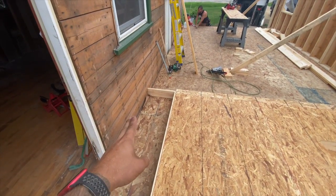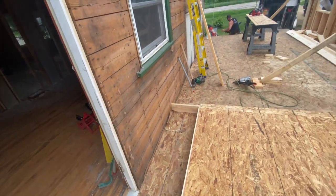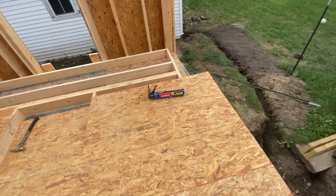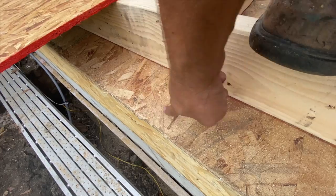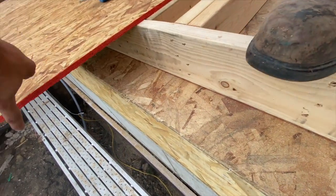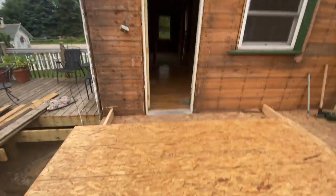We're going to leave this last stud out and fasten it to the wall nice and tight. We're going to pop this window and stand it up. Adam's going to run some PL Quick. The detail on that is to put some on top of this underneath the plate and then some on the sill where this guy laps into it. So that's the detail for those.